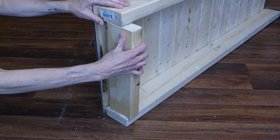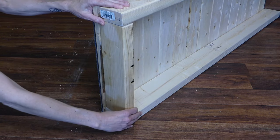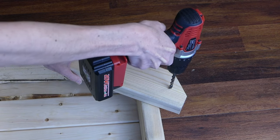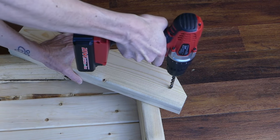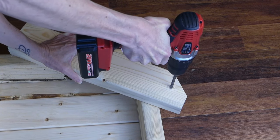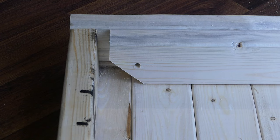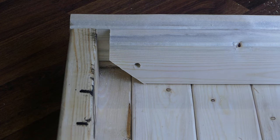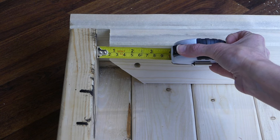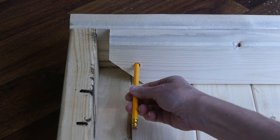Turn the ramp on its side and add the 13 inch 2x4 to the top end. Use a bit as wide as the bolts to drill a hole in the center top, and about an inch and a half down on the leg 2x4s — this should be at the cutout end. Place the 2x4 inside of the ramp so that the cut corner side is facing down. Leave a gap of about three quarters of an inch or slightly less between the 2x4 and the end of the ramp, then use a pencil to mark the hole on the ramp frame.